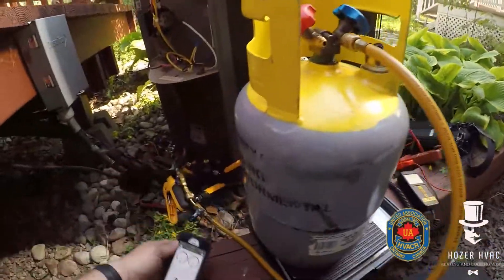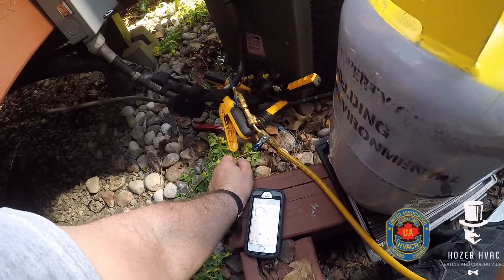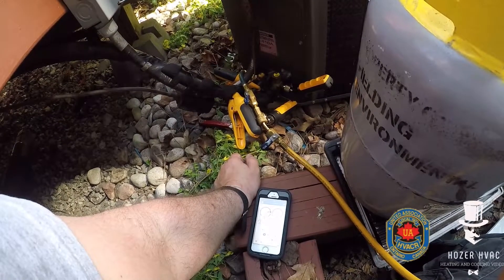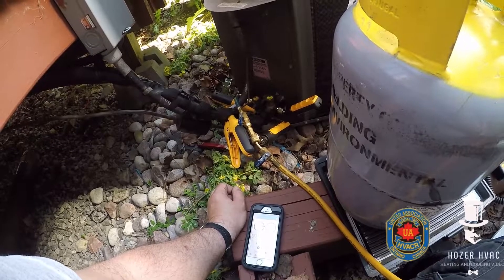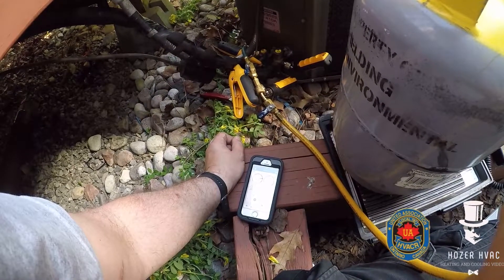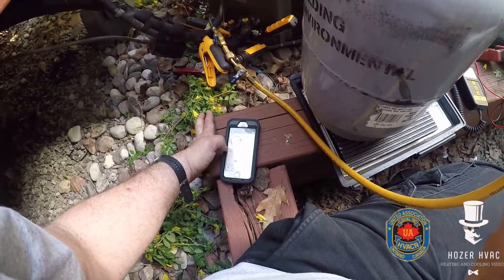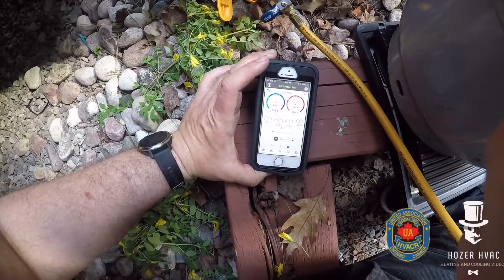So simple call — these 14ACX units have that high pressure switch that trips and we see it a lot up here. You have the cold weather and then on system startups for some reason it trips. Some guys have put hard starts to kind of help it — compressor kicks in faster to get the refrigerant moving. But definitely want to balance this one out so it's not overcharged. Right now I'm sitting tight at about 11 sub cool. We'll give it about 15 minutes or so and see where we end up. Alright guys, I call that good — 9 sub cooling, 12 superheat, pressures are bang on.